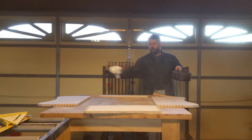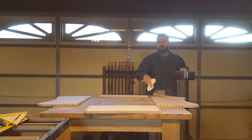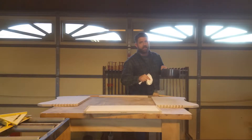I have my pieces. I went ahead and sanded them down lightly with 120 grit — that's much easier to get the corners and everything before you have it all glued together. Lightly sand down, and keep in mind if you're going to run over the fingers themselves, be really careful not to put much force down when sanding because we want a nice even glue up.